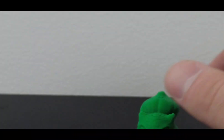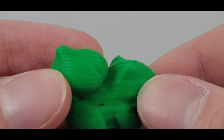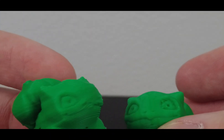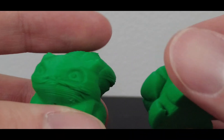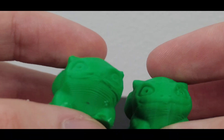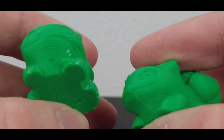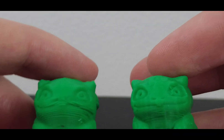It wouldn't look as poor. I think even with the 0.8, especially if you don't want a ton of detail, you could definitely get away with it. This went from 41 minutes with the 0.4 to 22 minutes with the 0.8 — those times were accurate on the printer — so you really can almost reduce your time by half. If you don't need fine resolution but still want some detail, I really think the 0.8 is a viable option. Hopefully you'll consider the 0.8 and utilize all nozzle sizes — not just the big ones, but go to 0.2 if you need more detail. Hopefully this helped. We'll see you in the next video.